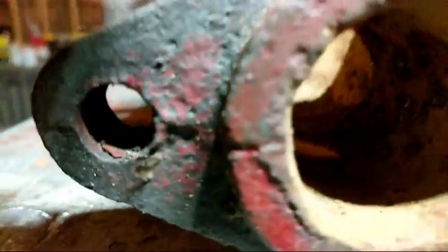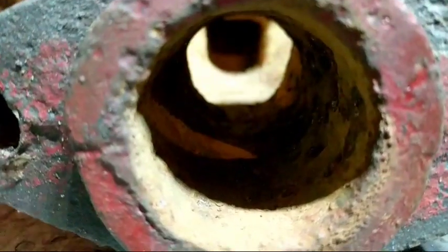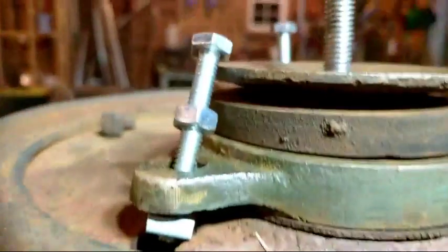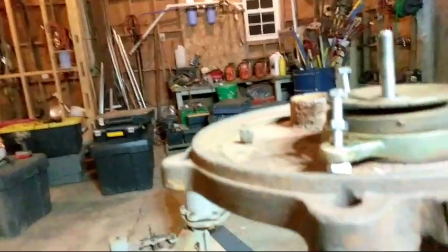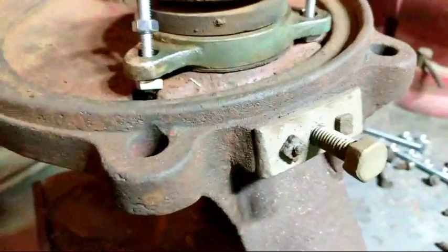Hey, I need a camera that can go over in here. This is the waste valve. There's the intake. There's the waste valve. So you're the water now. You're flowing down, and then you come up out of the waste valve. And then you go up this chamber, past the snifter, sucking in air through the inner valve, and then you go out the delivery pipe. Oh, I gotta stop losing all these bolts. Okay, so anyway, I hope I answered your question on the snifter.